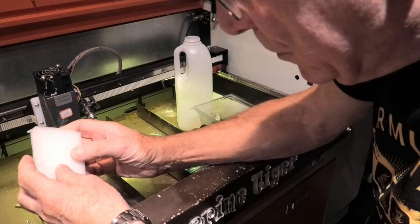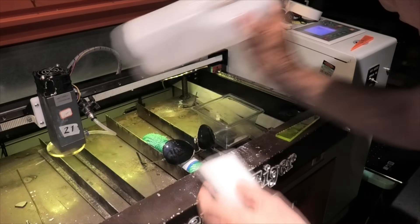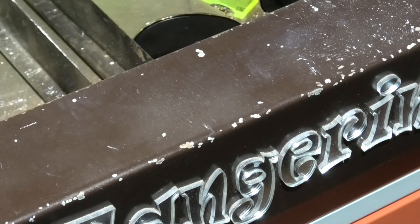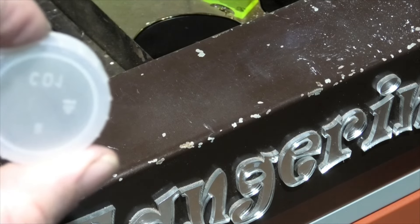If we get some thin two-millimeter polyethylene sheet it'll probably cut a hole in it — but on testing, we've just barely raised a mark on the surface, it's not even cut into it. Solid polyethylene has done exactly what we expected — virtually nothing. To be fair that was high density polyethylene, a slightly stronger version. Even the milk bottle lid says HDPE on the recycling triangle.